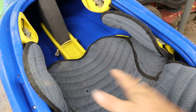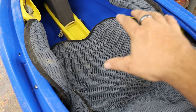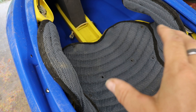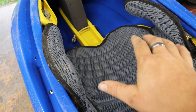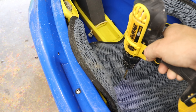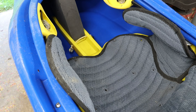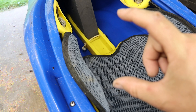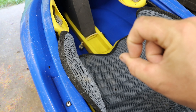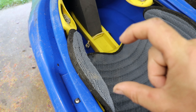Now things are starting to take shape. Everything is sort of pinned up roughly where it's supposed to be, and because of that all of these holes in the bottom are laid out where they should actually be. Take a second, make sure you wiggle everything so it's sitting properly. Then you're going to go straight through, slowly and lightly, and just pop the first layer. You have an inch or two of space there, so if you pop through the top and you're going light, you will not slam through and go through the hull of the boat.